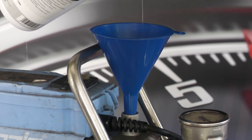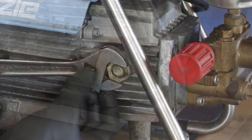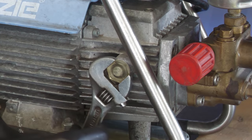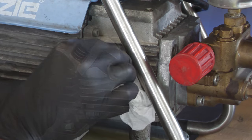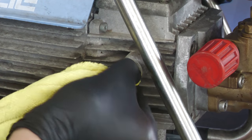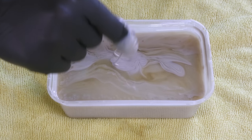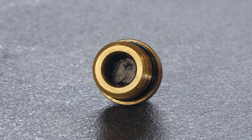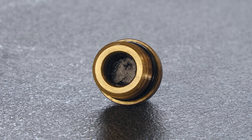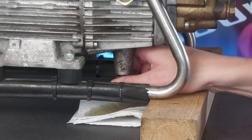Behind that it was then time to change the seven-year-old oil. After mounting the 20-kilo unit on a bit of timber, I removed the plastic filler cap up top to release any pressure, cracked the sump plug with a spanner, then removed it by hand before dropping it into the tray like a plonker. Because the old stuff was so stale I added a few glugs of fresh oil to help flush the chamber, and while that was draining removed the plastic indicator window to clean the inside of that and the threads behind it. After retrieving the magnetic sump plug from the creamy milkshake, I rinsed it off and removed any metal filings — of which there was a small amount — before refitting and securing it along with the freshly cleaned plastic window.